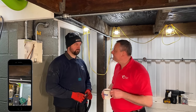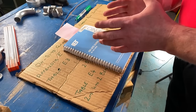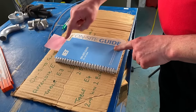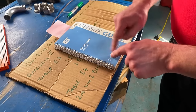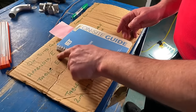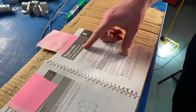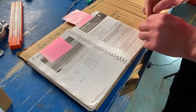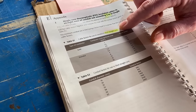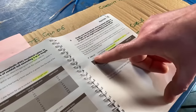To determine whether those six 2.5mm² and three 1.5mm² PVC singles could fit, I used the On-Site Guide. The cover on this edition is blue — always check you're using the latest version. We're going to use Appendix E. It covers cable capacity of conduits and trunking. Tables E1 and E2 cover conduits in straight short runs, but ours incorporates two bends, so we won't be using those. We'll be using Table E3 and Table E4 on the next page.